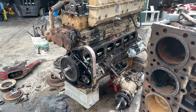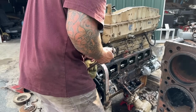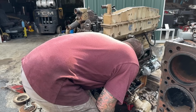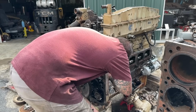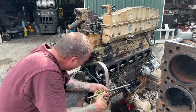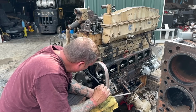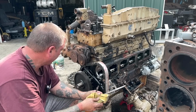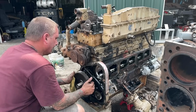Unfortunate. Wow. Super disappointing. And I don't think I can get that cam bearing off so that you can see what I mean. So what happens is that the camshaft gets a lack of lubrication, and as she digs a trench, she superheats that bearing, and that bearing welds to it, and then it turns the bearing in the bore, and so game over, guys, game over. Unfortunate. Money and time wasted.